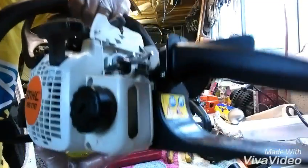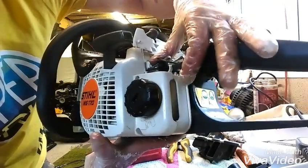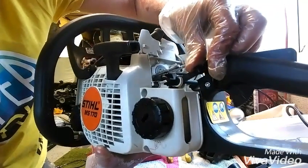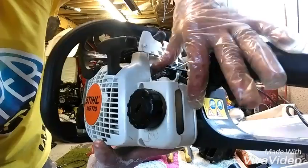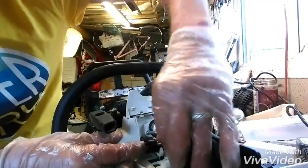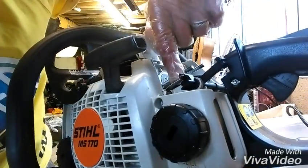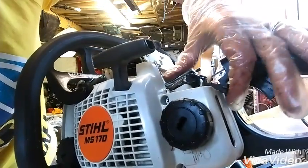We got it back in this position here. What they've done, they've put it in with the bar still underneath it, and it still does click when you push it down and up. So you think, oh it's clicking, it's right. But then what happens when you push it down, there's nothing holding it down - that is trying to push it up. When the chainsaw starts, this thing flicks out. So you've got to make sure that this clip comes on the top, so when it clicks down it's here, and when it clicks up it's there, pushing it down all the time.